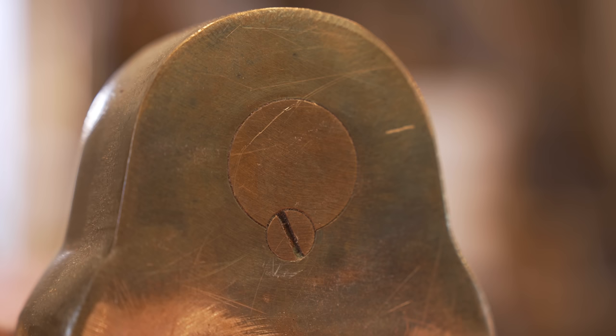He can do the same thing on the pintles on the actual rudder itself, only because the pins of the pintles can actually be removed from the hardware. And so when he's fitting them to the rudder, they are like the gudgeons in that they just have holes in, and then the pins are inserted. They're a friction fit, very tight fit, and there's a set screw which goes in the top to make sure they can't move at all after they're in.